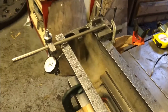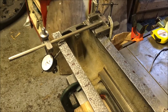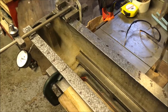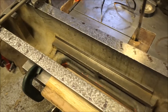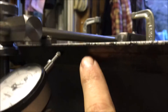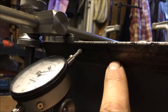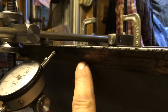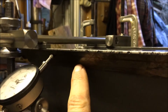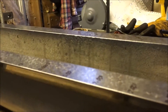Got a few modifications to do to the jig still, just to make the setup a bit easier. But all I'm really fussed about is just being able to get a consistent measurement. So that's checking along that line there — I'm going to lower the DTI and check it there, which, if my geometry is right, should give me the same variation that I've already measured.